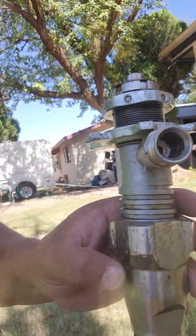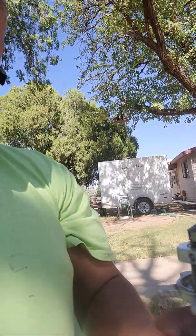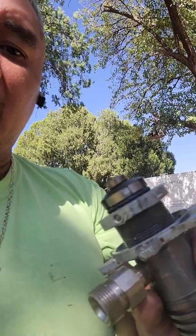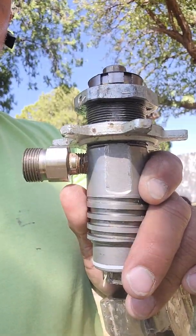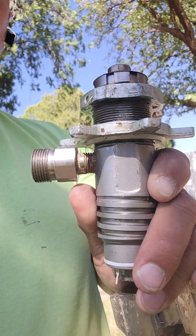So let's go ahead and replace this foot housing onto this shaft, because there was a piece that broke, and I believe that's where my problem was from the very beginning. Because I took this right here off. I replaced all your packing with all your new O-rings and your gaskets and whatnot, and there's about 20 or 30 of them in there, guys.